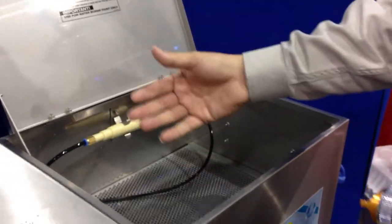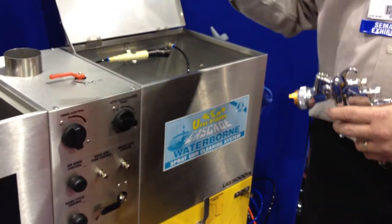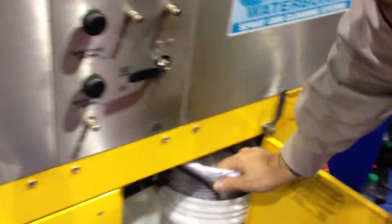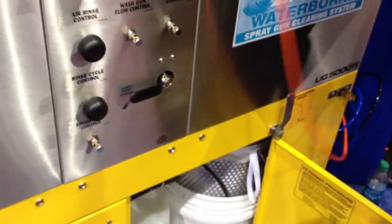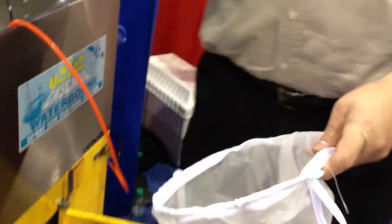When all of the supplied clean solution is pumped from the pail up into this tub, we would add two scoops of our supplied flocculant. We would agitate this tank for five minutes. The flocculant will stick to the coating. Thereupon, we drain it to our two-stage filters. Remove the filter, empty the waste, blow the filter back out in an appropriate paint receptacle, and reinstall and reuse. Paint companies recommend that you change your water out after every ten flocculations.